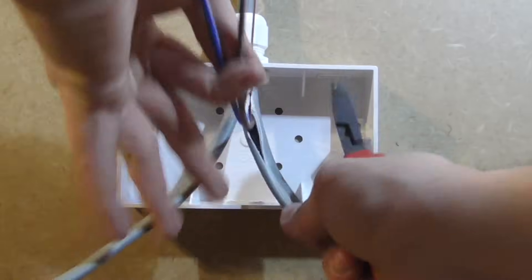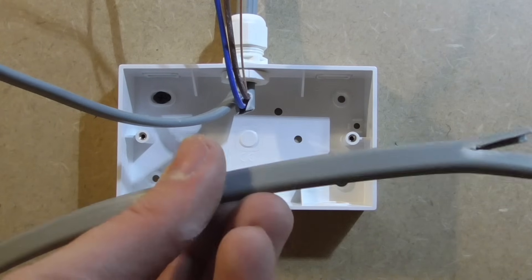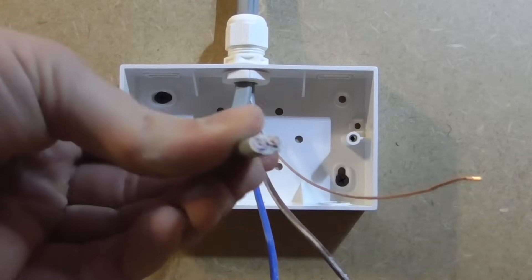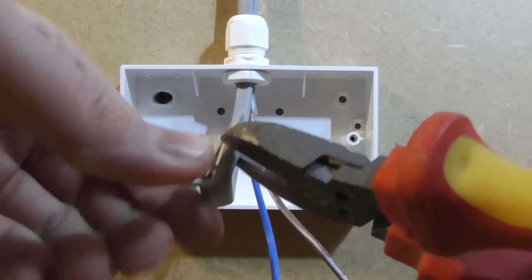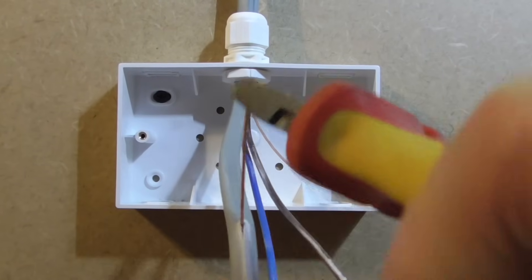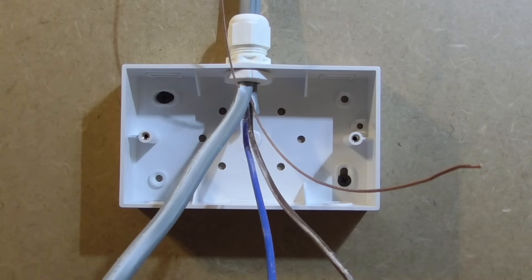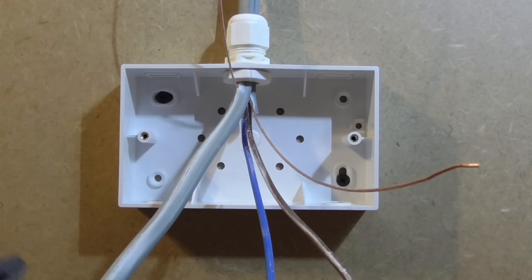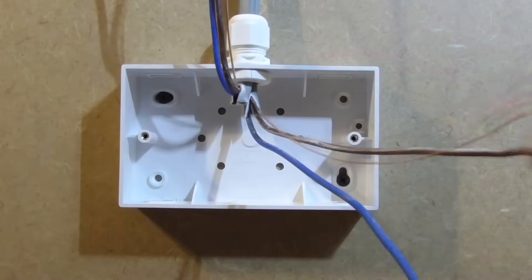You've got your two cables here. Just be careful when you do this — chop that sheath off and throw it in the bin. Same again for the next one. Slip down the middle and use your cutters to separate the cable, so you've got the bare earth wire which will need to be sleeved in a minute. Pull up. If you're finding it hard with side cutters, you can always use a pair of pliers — it might make it easier for some people who have never done this before. We're going to be taking the two conductors out of the outer sheathing, strip it back, and then this goes in the bin.